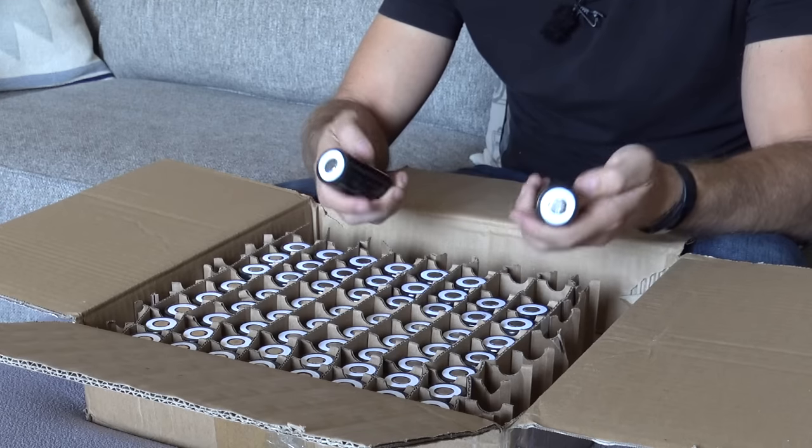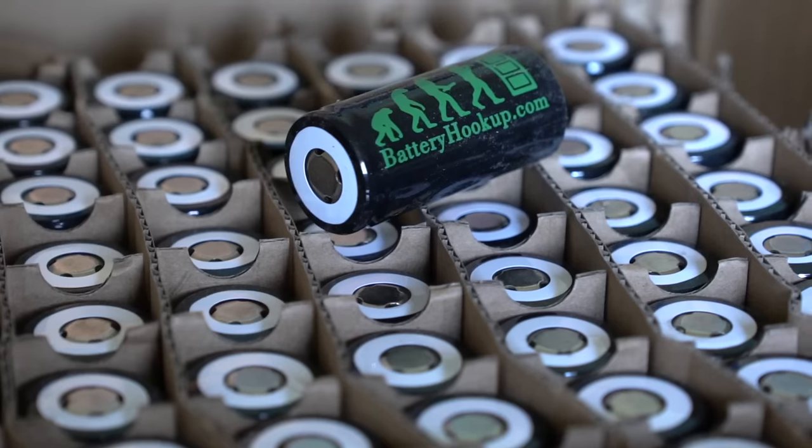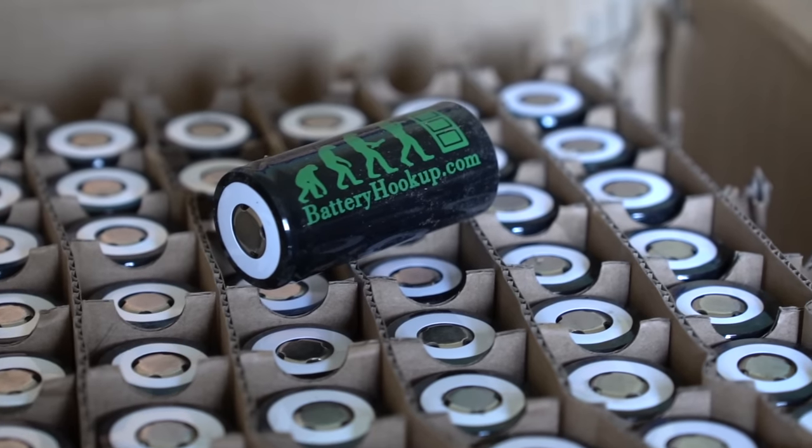Those are the main differences between lithium ion and lithium iron phosphate. Both work really well and it depends on your application. I've generally gone with lithium ion because it's cheaper upfront and there are more types of cells and manufacturers available, but it does have downsides like lower cycle life and safety. For my next battery I want to try these larger format lithium iron phosphate cells. I'll put a link in the description — they're $2.99 per cell, which is a pretty crazy deal. I've got 64 cells here for a 4P16S pack — four cells in parallel, 16 parallel sets in series — giving me a 48 volt, roughly 20 to 21.5 amp hour battery.